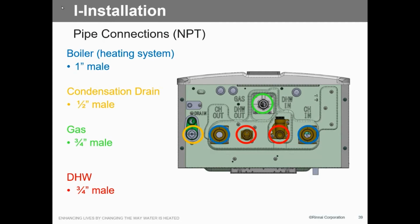We're using hot water to heat that plate heat exchanger. So we're not gonna see the fouling that we've seen in the past. It is so much more forgiving. So that's not gonna be a big issue. Yeah, you're still gonna have to filter it. You're still gonna have to, may have to clean it. But again, probably not gonna see a big issue with these because of that medium. Because we're using water to heat that. We're not gonna superheat that water and try to get it up to temperature.